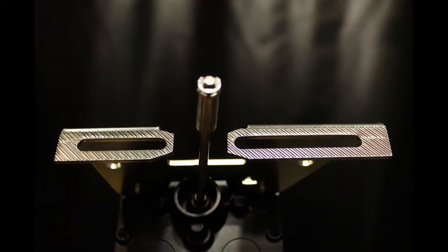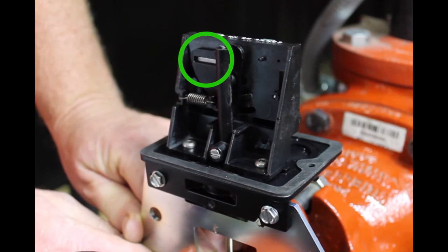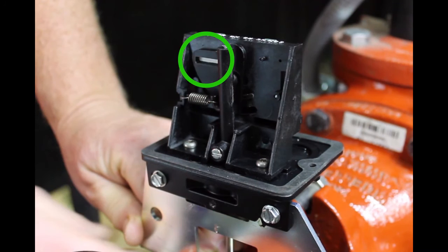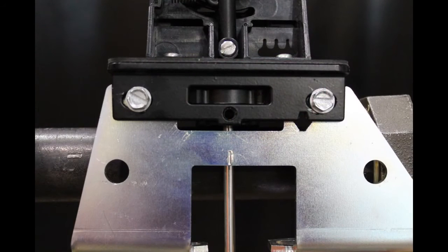The serrated surface of the mounting bracket helps prevent the device from slipping while tightening the carriage bolts. When mounting the OSYSU in this position, it is usually best to use the white indicator visible through the window to aid in initially locating the OSYSU in the correct position on the valve yoke. If you have to install the OSYSU in the opposite position, use the other indicators, the switch actuator, and/or the notch in the mounting bracket.